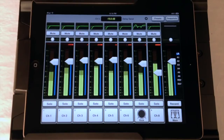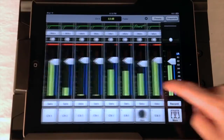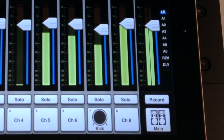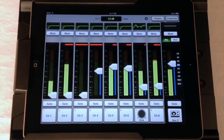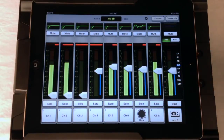Nice. Back to the mixer. Right now, my channel faders are showing me the level going to the main left-right mix. This is indicated by the name and image at the bottom of the master fader and by the output selector on the far right. To view a different output in its mix, simply touch, drag, and release on the output selector. Now I am viewing the aux3 master and the channel faders are showing me the levels going to aux3.